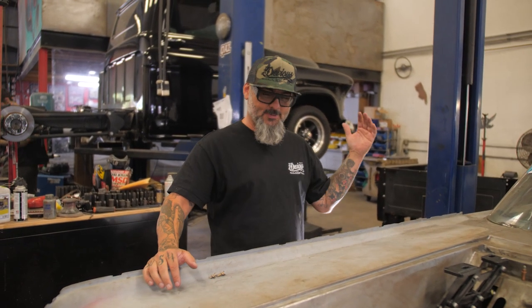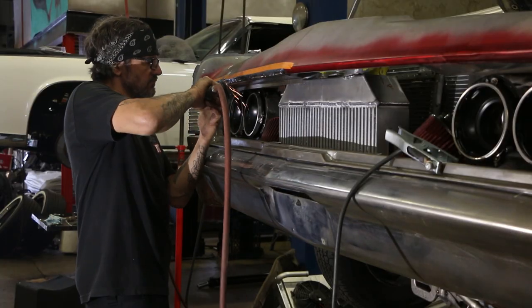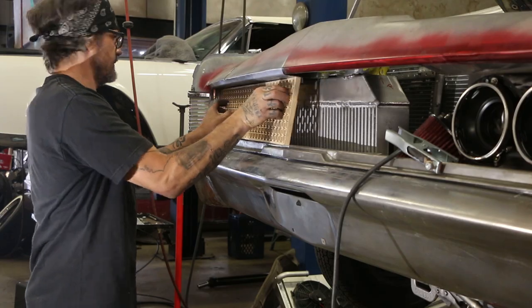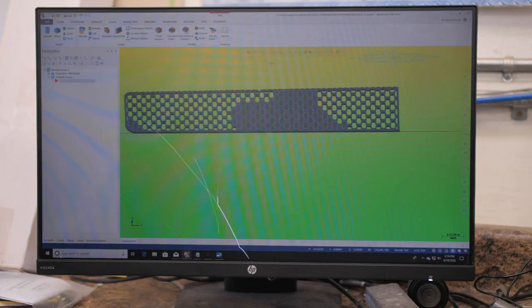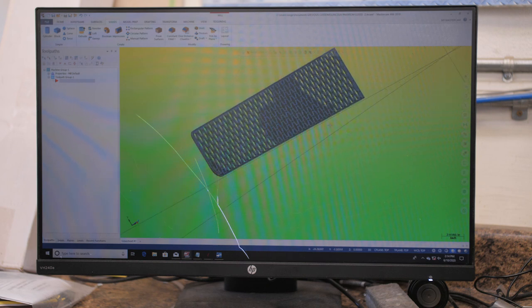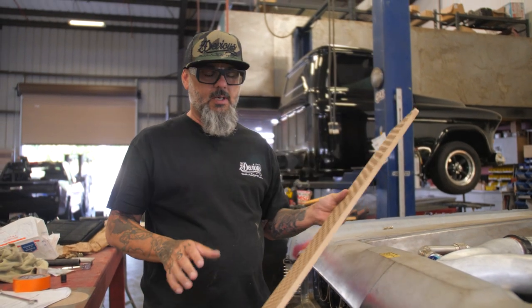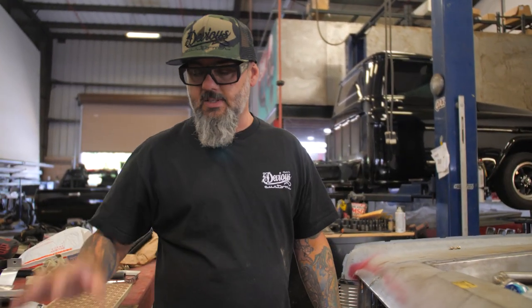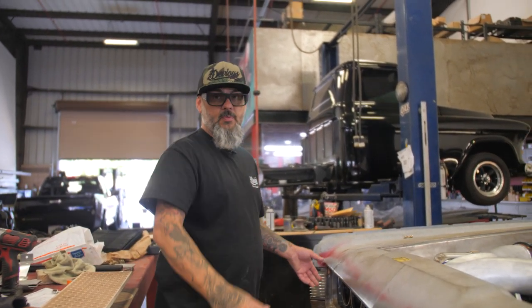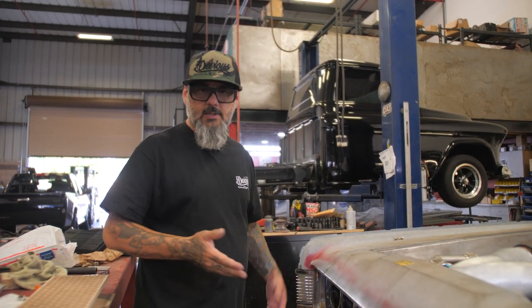Now to another cool part — this car is full of them. Check this out. We CNC cut the grill out of wood. We're doing kind of an old school trick — we're actually making a phantom grill that goes in like that. This is a test piece cut out of MDF just so we could see that it's going to work. We need to change a few radiuses in the corners and tighten it up a bit, and then we'll have two pieces that go here. This template will end up as trash basically — it's just to make sure we don't cut up a $500 piece of aluminum and have it not work. Next up we'll take it to the machine shop, get a piece of half-inch material, bolt it down, start machining, and the grill will be made. It'll have a little more contour to it. I don't know anybody who has one in a Lincoln, so we're the first.